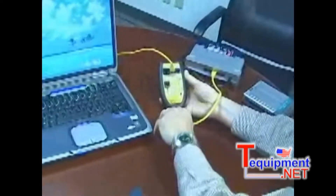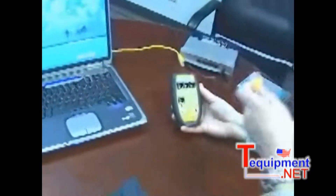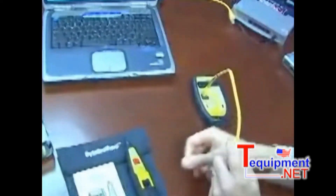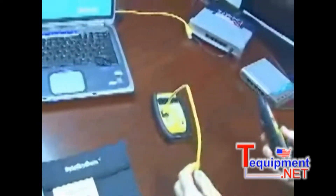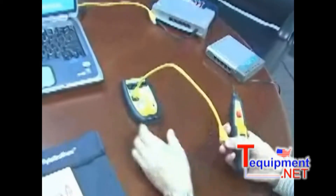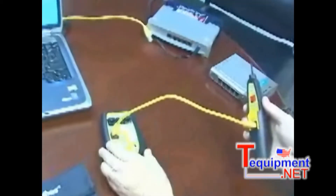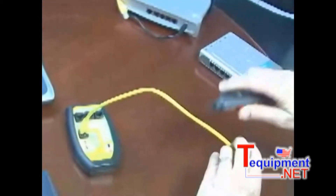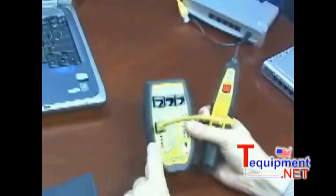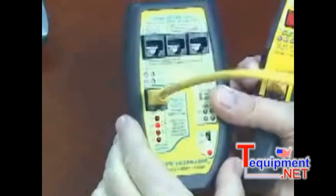A last feature I'd like to show you on the real-world certifier is its cable test ability. Let's use the cable test socket to test the jumper cable itself. You get a probe with the TBR1000 — you can use it like any other probe to locate the cable. Once you locate the cable, simply plug it in. So if you're in a remote wiring closet, you can locate it and then immediately plug it in. The main unit will continue to strobe the pairs 1, 2, 3, 6, 4, 5, and 7, 8 continuously.